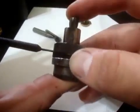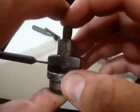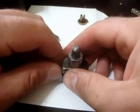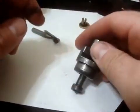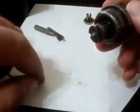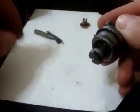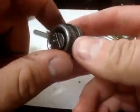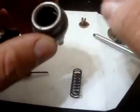So this pushes up, whereas this is trying to push down because of whatever it is pushing on it. The tank is pushing on top of it, which then breaks the pin or shears the shear pin and fires the mine. And in this case makes a nice little dent in the cardboard that's under that. So I'll get the spring out with the firing pin just to show what it does.